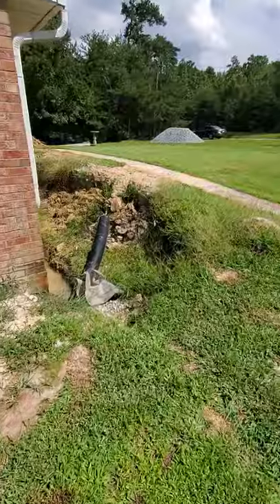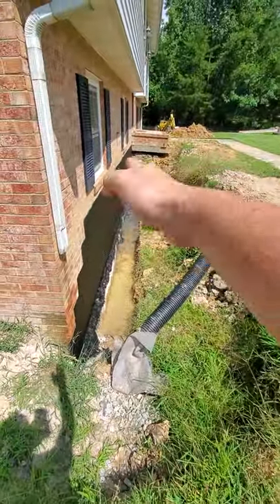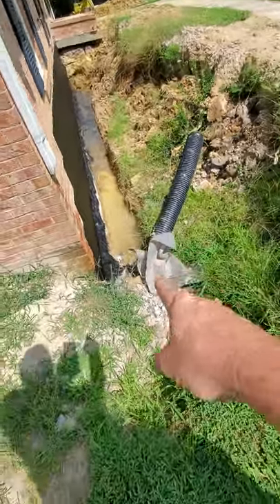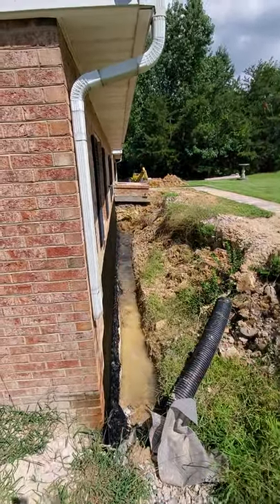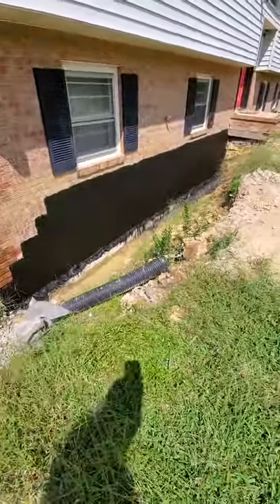So that's what we've done. We'll walk back up here and take another look at it. That eight-inch pipe you just saw — I'm gonna have geo fabric line the bottom here, it's gonna lay down in there. I'll hacksaw this corner six-inch pipe off; it'll connect to our coupler, go all the way down, and then that elbow will turn and go up beside the porch. This side's ready — I'm ready to put the pipe in.